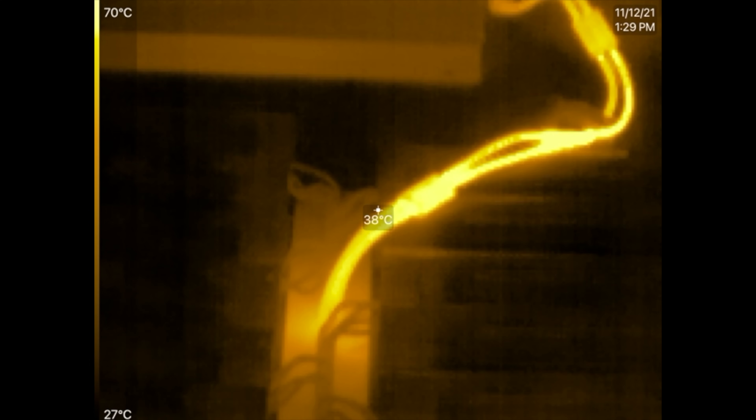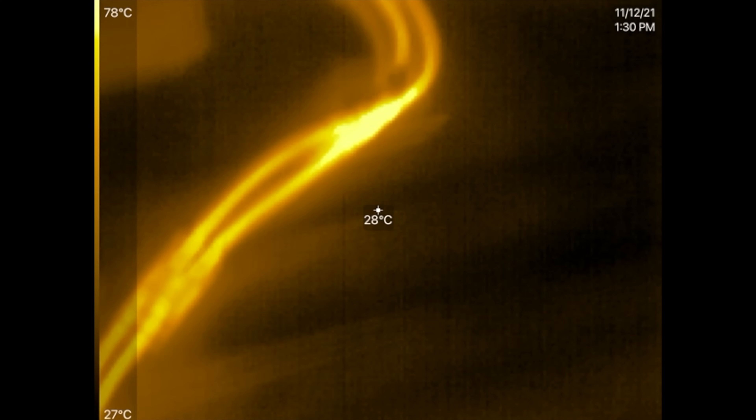At about 20 minutes, these are the working temperatures, and this is okay. This is 200-degree-Celsius-rated wire right here, and the PCB board material can handle somewhere around 200 degrees before it starts breaking down. Those connectors can handle 50–60 degrees no problem. This is the maximum — peak load. If you design your system, don't run it at peak because you'll get the least lifespan out of the connectors, wires, and batteries. This is where your max should be.